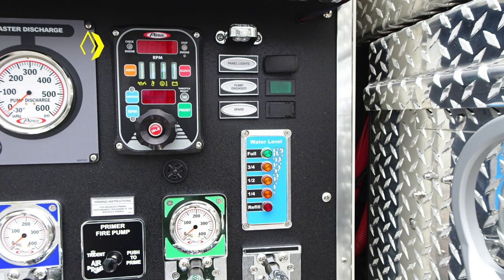Let's move just to the right where you're going to find your Pierce pressure throttle governor. If illuminated in yellow, it would be the check engine light. Located in the center, you'll find a digital readout regarding your RPM, and then moving to the right, if illuminated, it would be in red, would be a stop engine light. Down further, you'll find a menu button, which is the orange button, that is to select through the various menu functions. Located directly in the center, you'll find engine diagnostic information, and then moving to the right, you'll find a red silence button, which will silence the audible alarm.